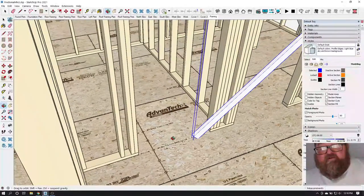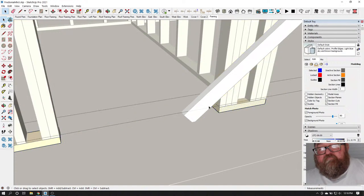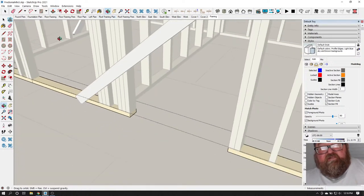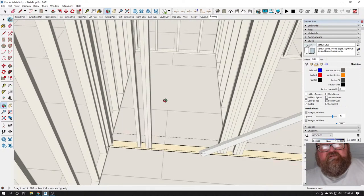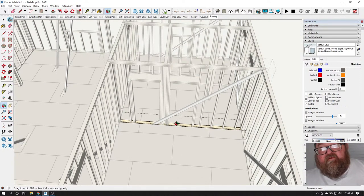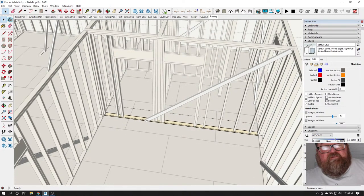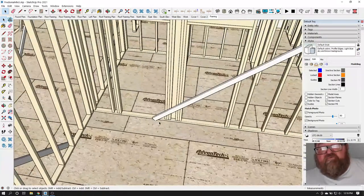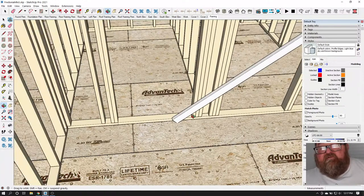These plates are not cut out when you're first framing. Your walls all still have one length of bottom plate. You don't cut the doors out until you're actually ready to set the doors — pretty much before you do drywall, you'll cut the plates out. The reason I bring that up is that the software extension cuts doors out for me, which is handy, but in real life this plate will be there, nailed down really good.